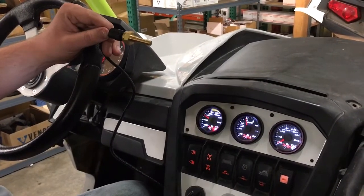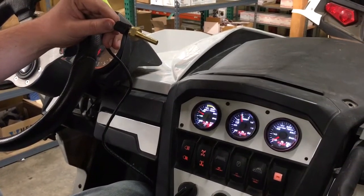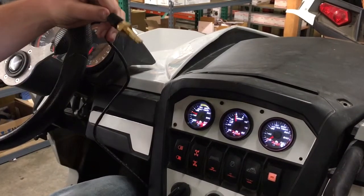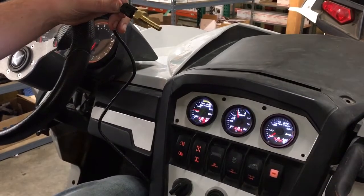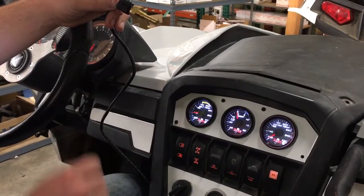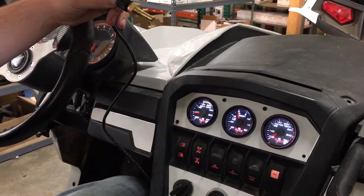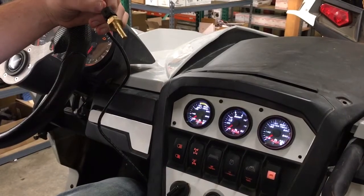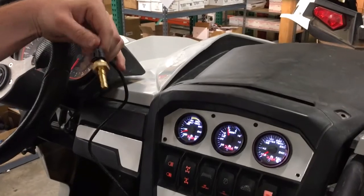As our fan is cooling our belt down — I have it unplugged for video purposes so it's not too loud — our belt is at 150 degrees. We'll blow on it a little to cool it down. Getting down to 145, 142, almost out of our temperature range — our LED kicks off, our fan kicks off, and we're good to go. At this point, put the sensor back in and you're ready to rip. If you have any questions, give us a call at 619-562-0180. Thanks for your order — let us know if there's anything in the future.